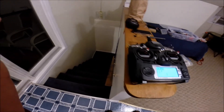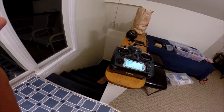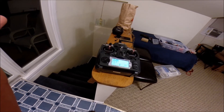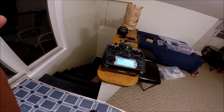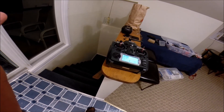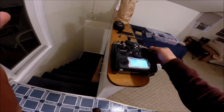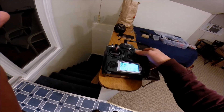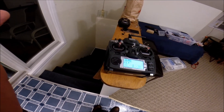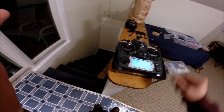I'm not going to lie — it's a big job. It took me almost a full day to figure out how to flash the firmware, solder those wires, make the six-pin header, and use the USB ASP tool. Then it took another few hours to mount one gimbal, and a few days later I did the other one. But if you like your 9X and one of your pots fails on a gimbal, it's definitely a good way to salvage a radio. I'm glad I went through and did it. Thanks for watching.